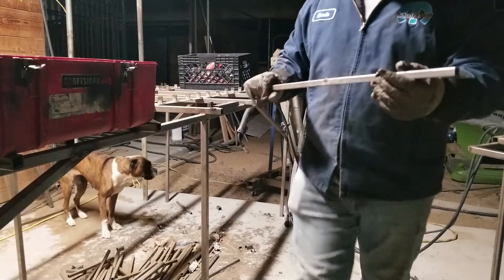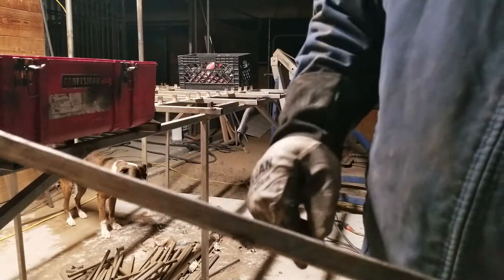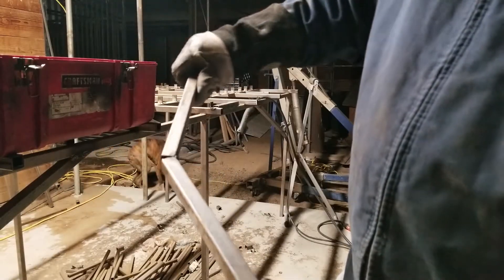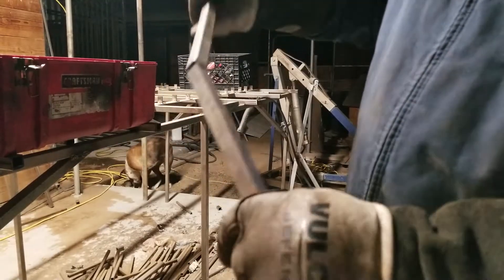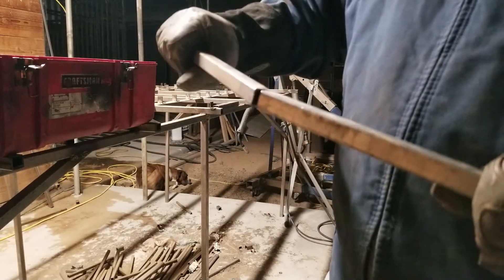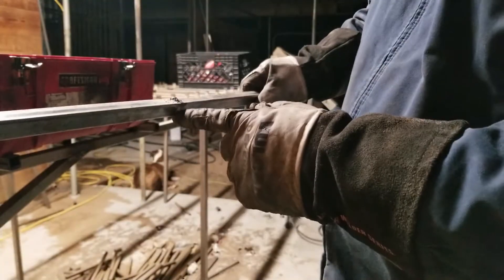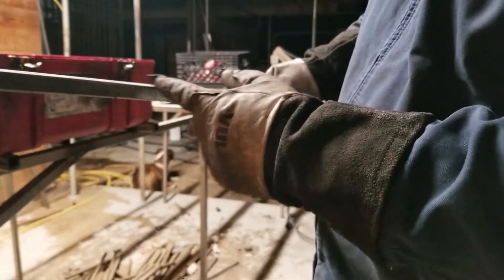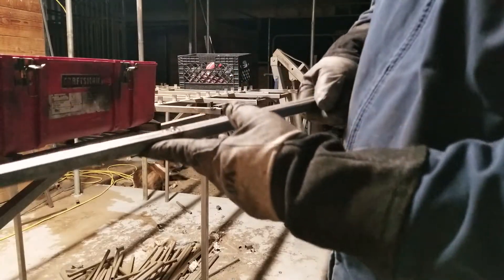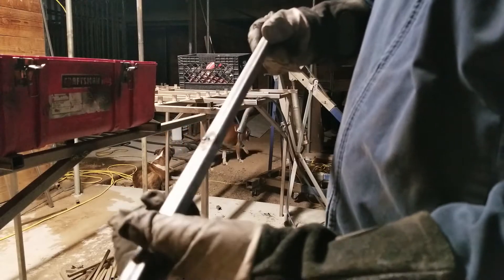Let's go ahead and check it out. No breaks, no tears — still good to go. If I obviously bend it in the opposite direction, yeah, it's going to bend. But that's to be expected because welds aren't designed to make the metal invincible — they're designed to make the metal stick. If this little bead would have broken, it would have meant either my welding was inferior, the metal wasn't thick enough, or I'm using the wrong settings. But even though it's not the nicest looking bead — it came out really messy — I didn't try to make it look good. I just tried to make it work, and it ended up working.